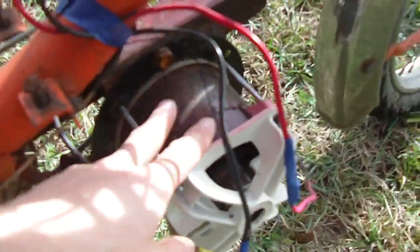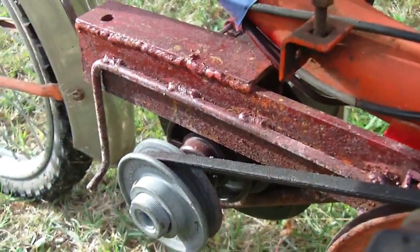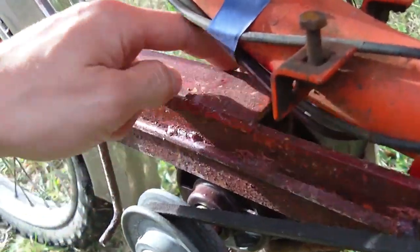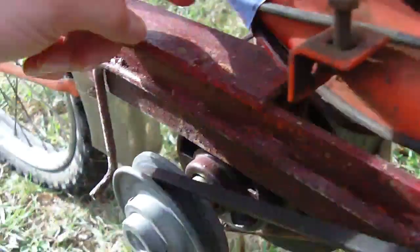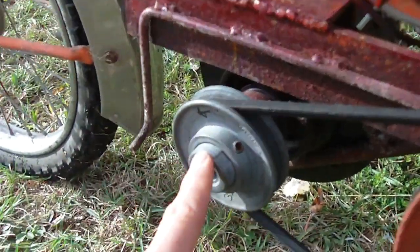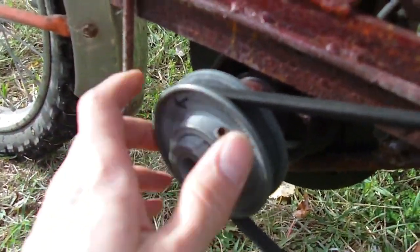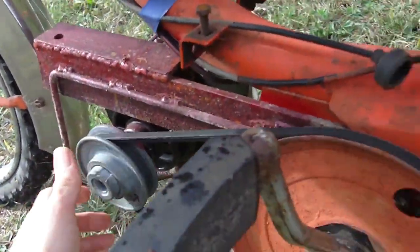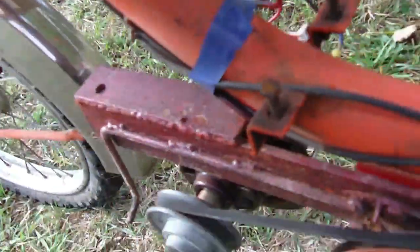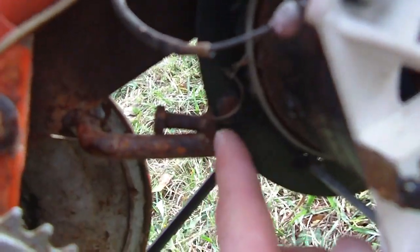Here's the 24-volt lawnmower motor — it's attached with a piece of angle iron or flat stock. I put this rod on here; this is just a piece I found and welded on to protect the belt, I guess. I randomly put this together, then I welded another piece of angle iron that bolts into the top of the motor, and then that bolts into the original bike frame. This pulley was off an electric motor — I converted it to fit. You can see my arrows so I know the direction. This is a belt drive bike, so it's really simple to convert.